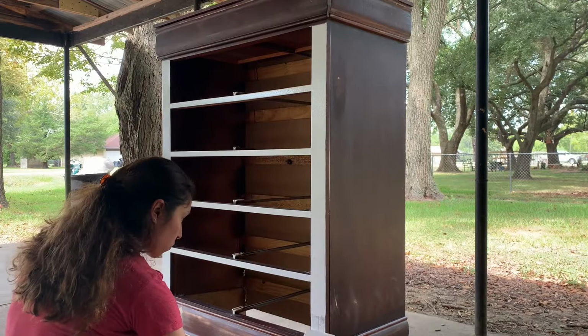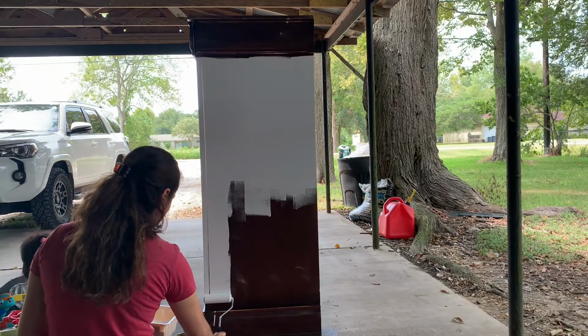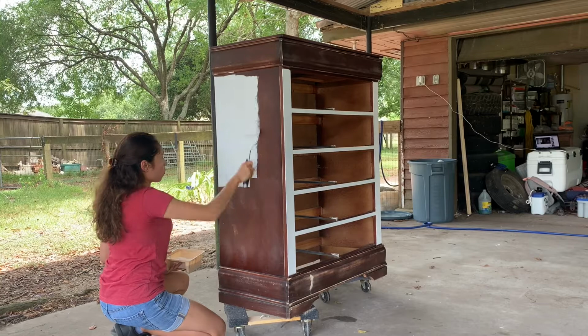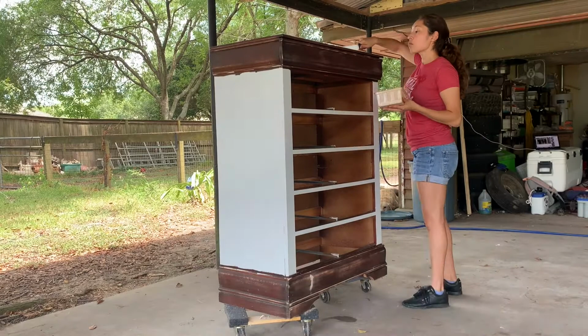I find that for beginners, a foam roller is a lot easier than a brush. And like I said, it covers a lot more surface area, so it may not be as daunting a task as opposed to using a brush. Now, I do use the brush on the smaller areas where it's more small detailed. But for the majority of the project, I do use a foam roller. And I did want to mention that I am using Behr Marquee Paint in pure white semi-gloss. All of the products that I'm using in this video, I'm going to be linking them down in the description below for you.